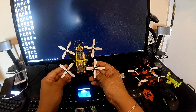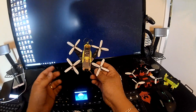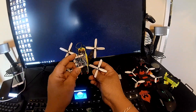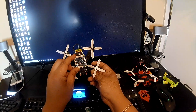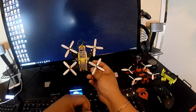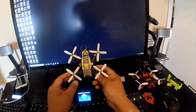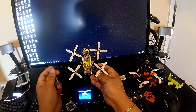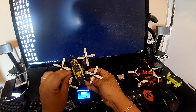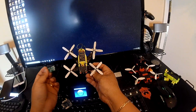This thing is running on a flip 32 mini flight controller, because a regular-size flight controller is actually bigger than the quad itself and won't fit. You have to use the flip 32 mini, an afro mini, or the SP F3 flight controller — basically any mini flight controller with about 25mm width on the side will fit in there.